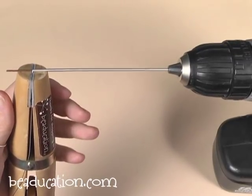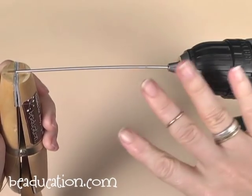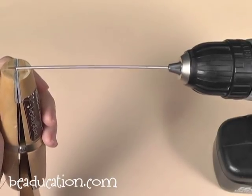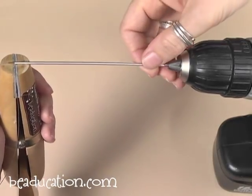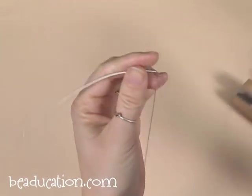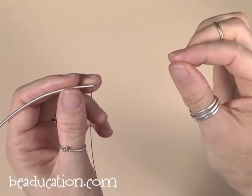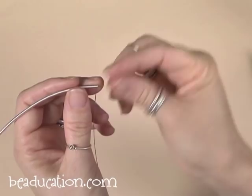As I'm almost to the end, I'm going to slow down and stop here. Before you remove anything to take off your coil, put the drill in reverse and give it five or six turns — it will pull the tension out. Otherwise it's going to flip back when you let go. Now I can just slip it right off. If you have a hard time slipping it off the core wire, it means the end of your core wire wasn't cut properly. Don't try to pull it straight off over the end, as it will pull your coil apart. Just file the end of your core wire for a smooth slide off.